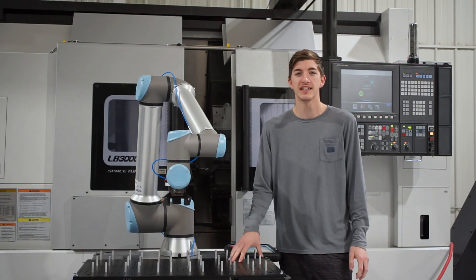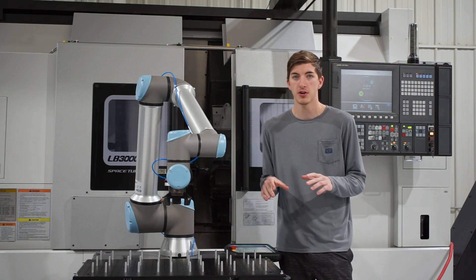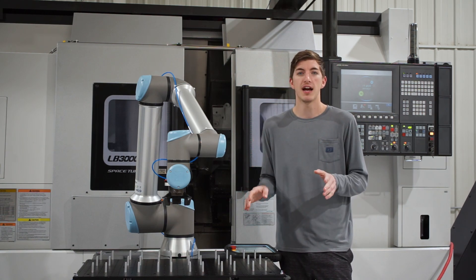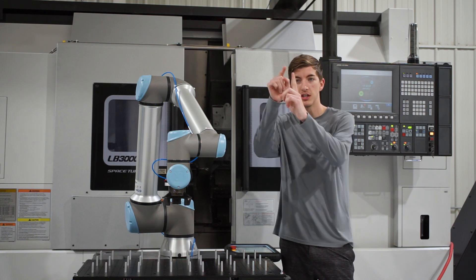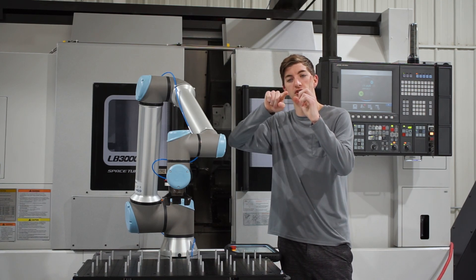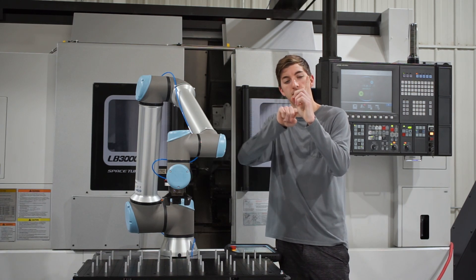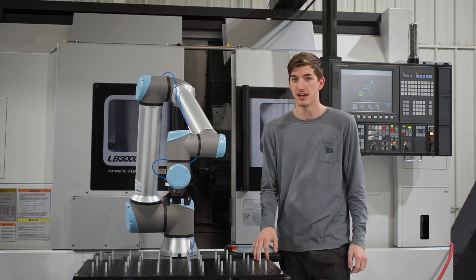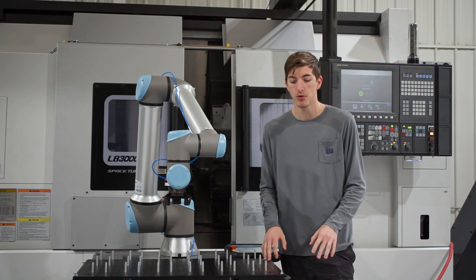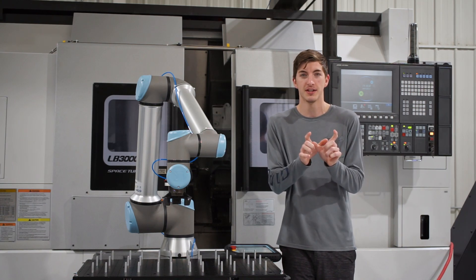I hope you can see how quick and easy that is to set up and use in real time. This can also be achieved with diamond plate — if you just have sheets that are cut like diamonds, laser cut or whatever, that's a little different math but absolutely doable. The triangle is just going to be between the center point and the stock, the bottom of the diamond, and wherever your part touches the metal — that's going to be your radius, and that's also going to be the part radius. So that's actually simpler math. Also, if you're worried about reliability and parts moving on the table, angle it — put it at an angle. Then you have gravity working in your favor and everything slides down into your desired datum points.